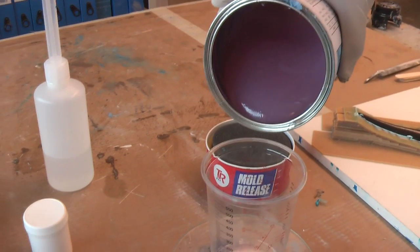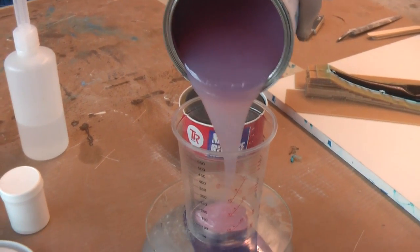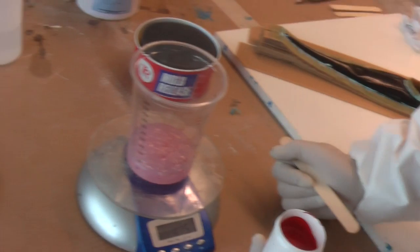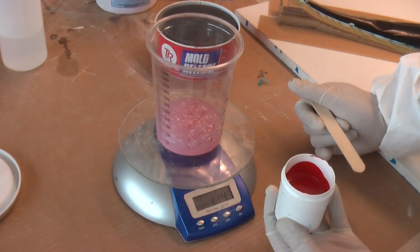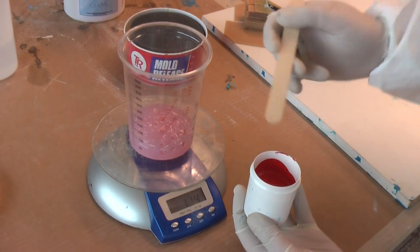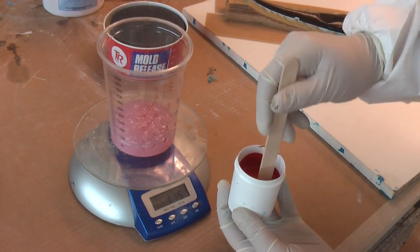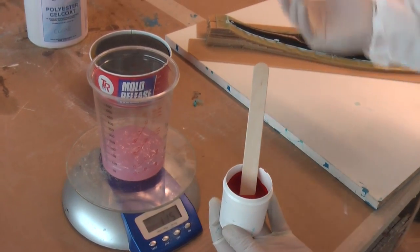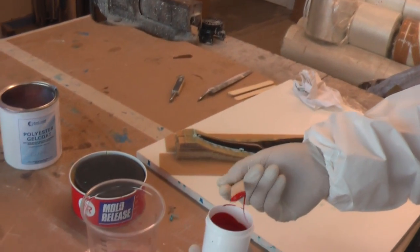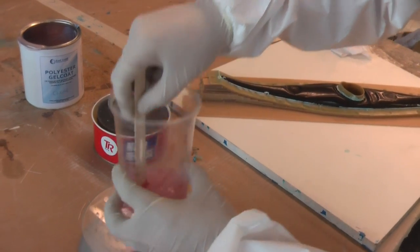I'm going to mix a very small amount — I'd guess no more than about 100g for this pot, if that. Now when you're mixing small amounts, say like 100g, it's very hard to get the ratio exact. So as long as you don't over-pigment it — when you're mixing up a gel coat for a mould, you only want just enough pigment to colour the gel coat. The more pigment you pour in, the weaker the gel coat becomes, which you don't want in a mould. But it's best to have a pigmented gel coat just so you can see where you're applying it when you come to manufacture the parts. I'm going to put just a very small amount of red in, literally just dipping the stick in, and mix that with the clear gel coat.